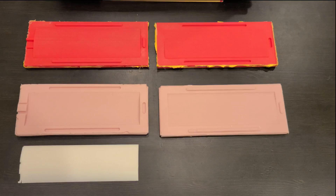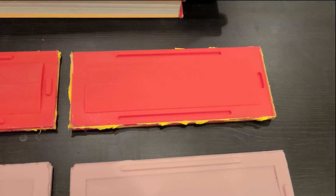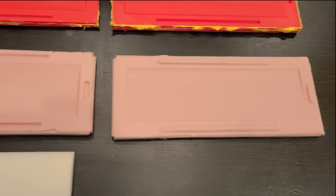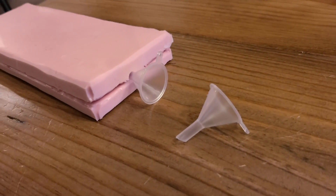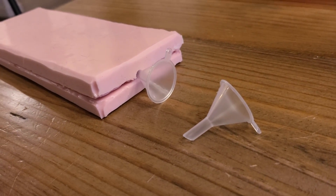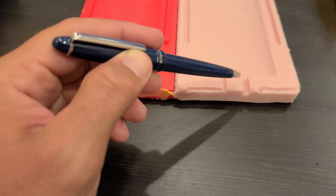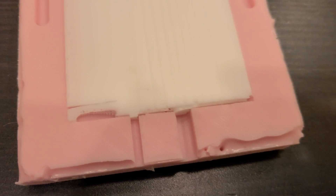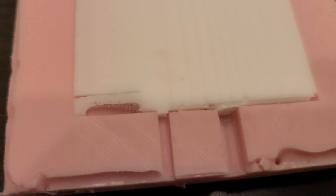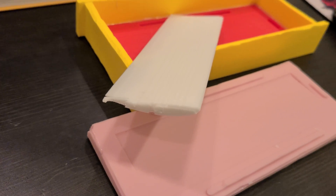To be perfectly clear: I'm designing and 3D printing mold negatives that I use to make the actual silicon molds, and from those silicon molds I cast a resin part. I use little funnels to pour resin into the mold through the fill hole, and there's also a smaller overflow hole — when resin starts running out of it, I know the mold is completely full. Bubbles form at the highest point in the mold, so you either need to plan to release them, or in my case I just trim the airfoils to shape.